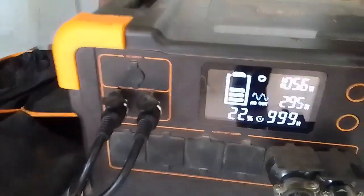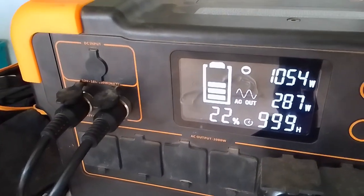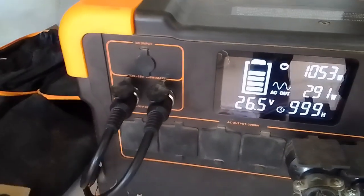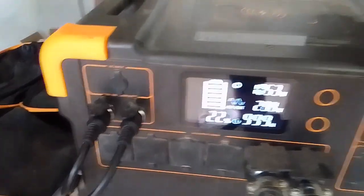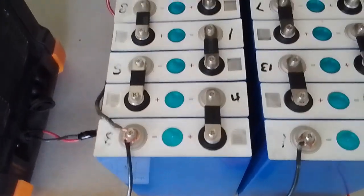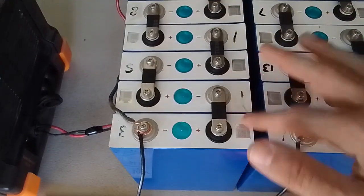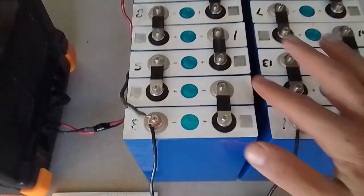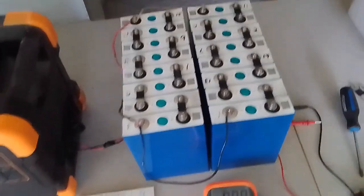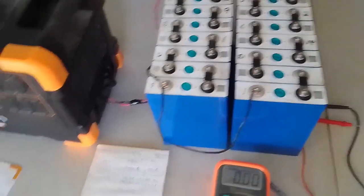About 11 o'clock, nice and sunny out, charging at our full solar capacity — just over a kilowatt. We're at 22 percent, which this thing thinks is 26.5 volts. Same solid copper wires I was using in the lead acid — they're slightly warm, but this is pushing the maximum current it ever would into these batteries. The weakest part of this whole thing is tapping buttons on the phone. The permanent marker is basically dry erase — I'd love to figure out a better way to put some numbers on these. EBTV usually has a sticker sheet, but I thought I don't need a sticker sheet, I'll just use permanent marker. I don't know if it's just this plastic or if this permanent marker is a real piece of junk, but that's no good.